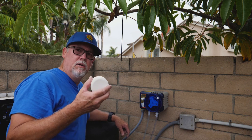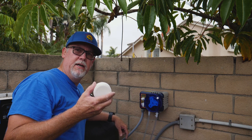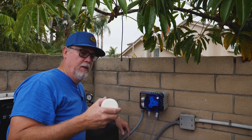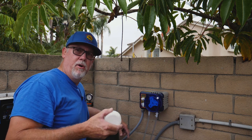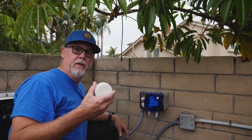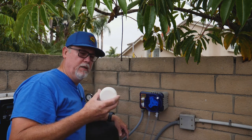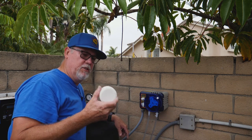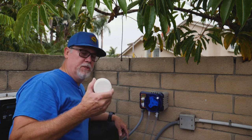These tablets are meant for homeowners who take off for two weeks on vacation — you drop them into the pool. Pool guys, if you have a party, drop these into the pool to keep that chlorine up and then pull them out. These are not meant for full-time sanitation. That's not what they're for. This is a really good product if used correctly, but a lot of guys are not using it correctly.